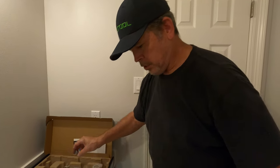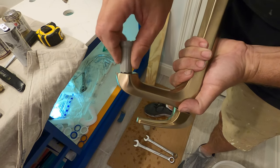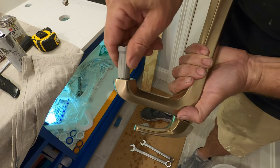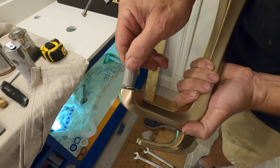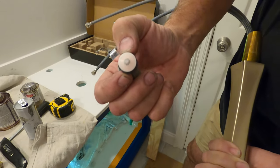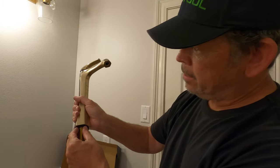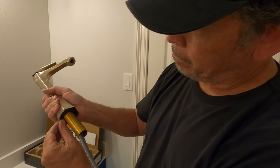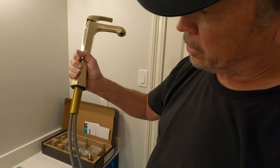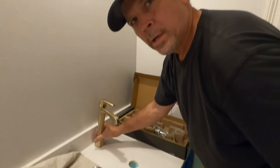The first thing we're going to do is remove the aerator because we want to bleed the lines in case there's any trash in them. It actually comes with this little aerator tool. Look how small those mesh holes are — it'll get clogged up very easily. So we're going to set it aside for now. No plumber's putty needed — the manufacturer doesn't specify it. There's a black compressible washer here and that's going to be our seal. I'm always mindful of when to use plumber's putty and when not to, because it can stain certain materials.